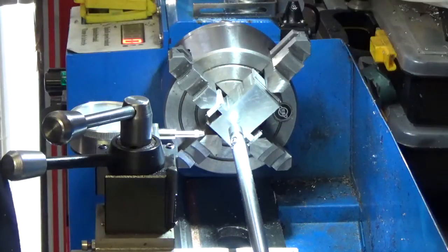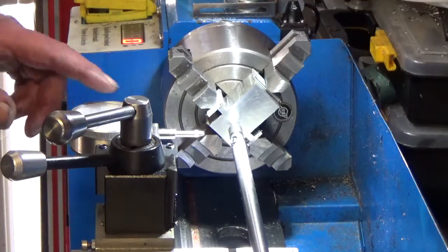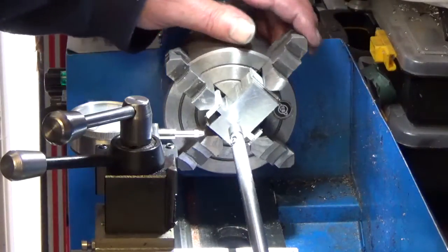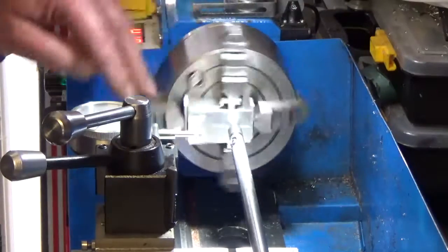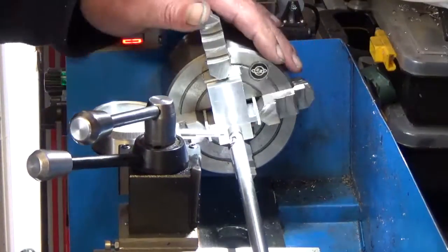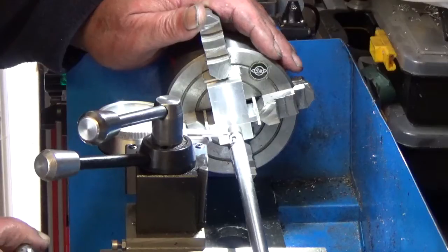Unfortunately, because I haven't got the facility in this shed to give you clock shots and every other shot, you don't have to take my word for what it says on the clock. So we just fasten that down — it doesn't look too bad. It's nowhere near centre but it doesn't look too bad. First of all you bring your clock into the end of the sprung centre. I usually give it a couple of millimetres at least, and I've got my zero at the top.